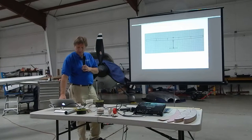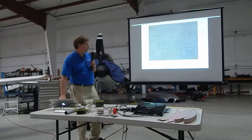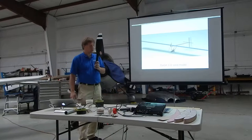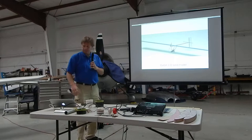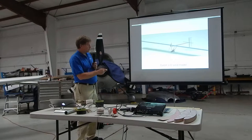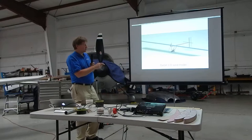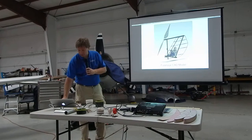When we first designed the airplane, we had a bunch of sketches like this — just everything by hand. Eventually we did build a solid model and did full finite element analysis on all the structural elements in the plane using SolidWorks. This basically shows what our plane is like: it's a carbon fiber frame with a fairing around it for the fuselage. There's a twisted bike chain going up to the propeller. It's a cruciform tail, and there's a carbon fiber spar inside the wing going all the way along.